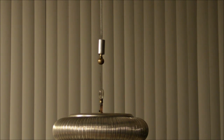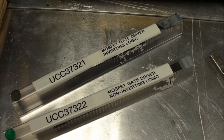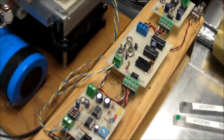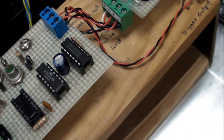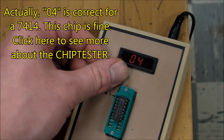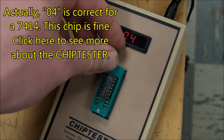Apparently not — something's still broken. I was going to poke around with an oscilloscope on the driving electronics, but I figured I would just swap chips in and out. So I replaced the MOSFET gate driver chips — these chips drive the gates of the IGBTs. Those are the old ones, those are the new ones. Turned everything on and still got no action. So I popped out the logic circuits one by one. The 74HC14 put into this chip tester — it should say 14 if it's working but it shows me 04, so I guess I'll put a new chip in there.